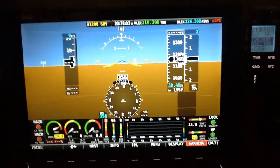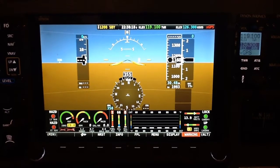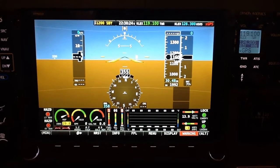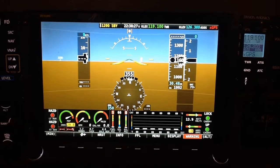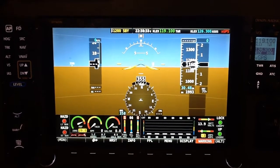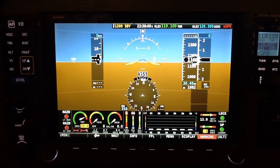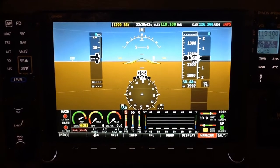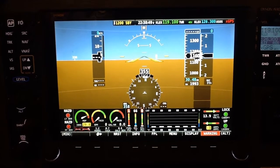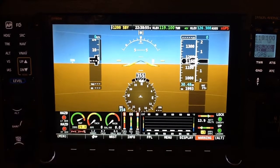These were sensors available on the EMS220 part of the Dynon system, and I thought I'd put them to good use. The switches were already there — they were part of the original circuitry in the plans of the airplane. But I decided that rather than have them all hooked in series, where basically three things tripped a light or sounded a buzzer and you had to figure out what it was, these describe exactly what's going on. I'm very happy with it.